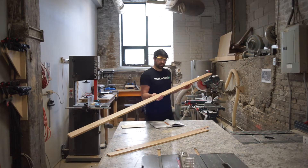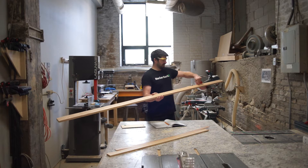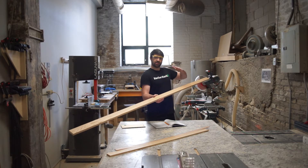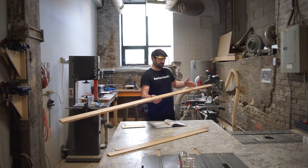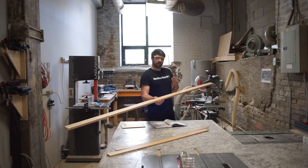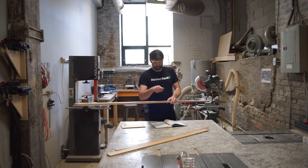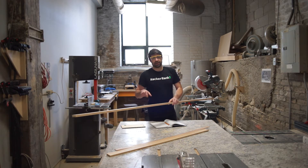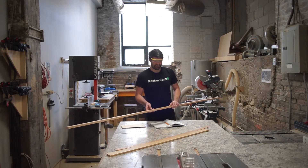To build the frame, what I'm going to do is take this piece of oak and use a router to cut an inset along the edge, which is where the mirror glass will sit inside the frame. Then I'm going to cut some 45-degree angles to size, glue those corners, put the mirror inside, and put a support bar across the back which will mount to the monitor already hanging on my wall. Let's give it a try.